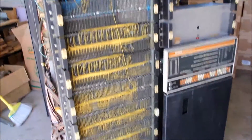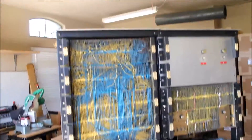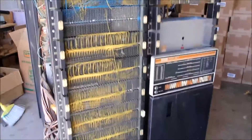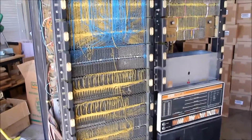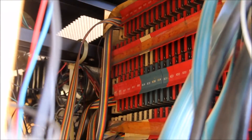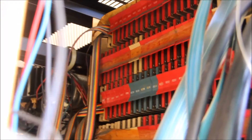Couldn't really see a good picture of it. When I saw a picture of it there were several pieces of black or clear plexiglass put over the front of all the wire planes here, and somehow those have been removed. Now that I see what it is, it's actually a large number of DEC flip chips and what I'm guessing is it was controlling an assembly line. You can see there's a lot of cards — a lot of R-123, R-202, R-107, R-151, several W-103s which I'm sure just extend the signal.